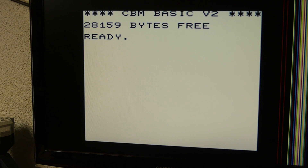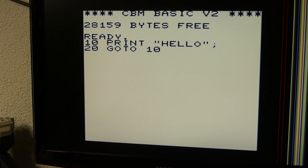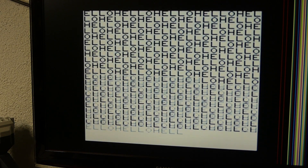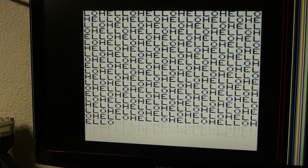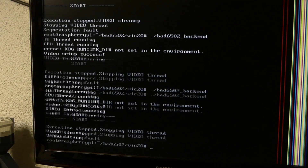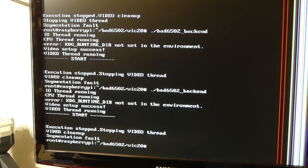So with the now working keyboard, I can enter the shortest program there is. And if I run it, you can actually see how fast this thing is going. It is actually quite a bit faster than a real VIC-20 would be, mainly because the implementation of the video chip is not stealing memory from the CPU or memory timing, and secondly I'm running at twice the clock rate. The VIC-20 was running at one megahertz — I'm running at two.